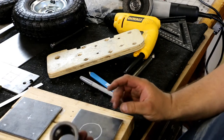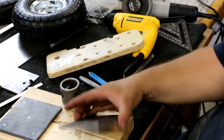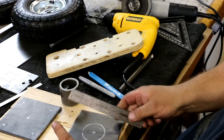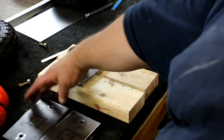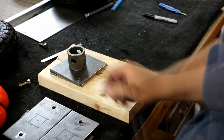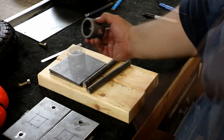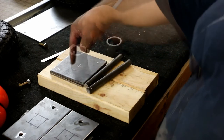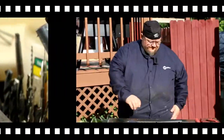The next thing I've got to do is make a plate to mount this. This is the part that normally would get welded onto the side of a trailer. I've got this thick quarter-inch flat stock that I cut down — it's about four and three-quarter inches square. We've got our two posts ready to go, the two plates, our two axles marked and ready to be drilled, and the mounting plates for the coop itself are marked and ready to be drilled out.